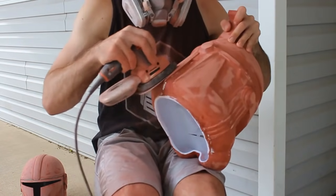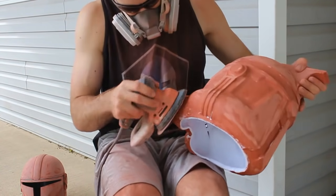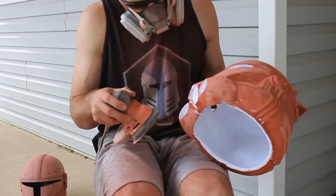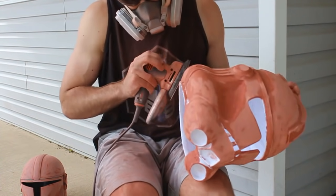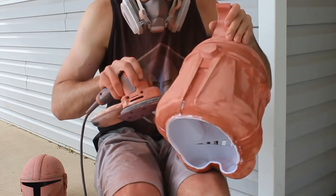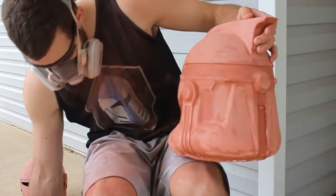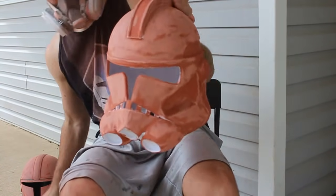Just be mindful of that as you're sanding. I've also got a little leaf blower to blow off excess dust and help identify spots that still need sanding. This step isn't really about getting every nook and cranny — just the large pieces to save some time. Also make sure to wear a respirator or dust mask since we're creating a lot of dust. Once done with this step we'll move on to hand sanding to get the rest of the little details.